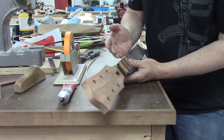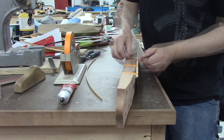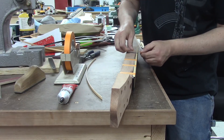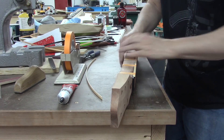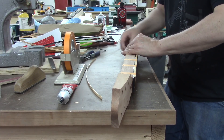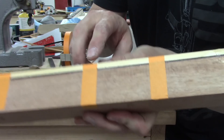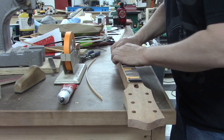Because the binding is taller than the fretboard, you want to make sure you're not letting it roll over — really go ahead and push it down and sock it in there. Make sure you're pushed all the way into the rabbet that you made. You can see there are some little binding goobers coming up, which means you're doing your job — just like when you glue two pieces of wood together and get that satisfying squeeze-out. Those little guys are actually binding that's melting and poking out. Everything looks good all the way around.